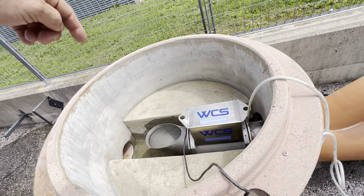I'm reducing my flow from 300mm through a 200mm, so I might have a little build-up at the back and possibly some surcharge. If there is surcharge, I'll have to increase the size of my flow meter. But generally going from a 300 down to a 200 isn't going to give you that problem, and you get very accurate flow control. I'm at the European Pipeline Center in Austria.